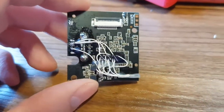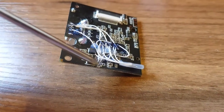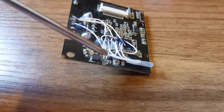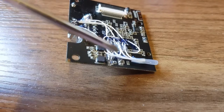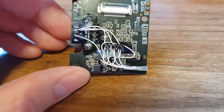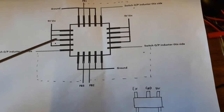I've added all the flying wire leads onto the new buck converters. It was quite tricky — especially the very small pads — and you need very fine leads. Effectively I've got three buck converters wired up to replace the three converters that were in the one package. I've wired them to the power coming in at the USB to save space on the very cramped footprint. I've also made up a pinout sheet to show how to wire it in.